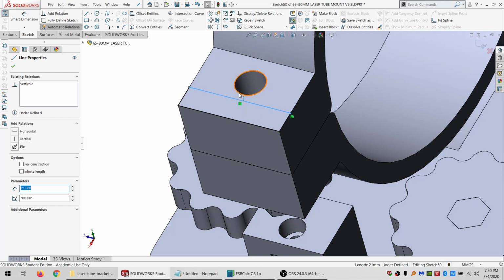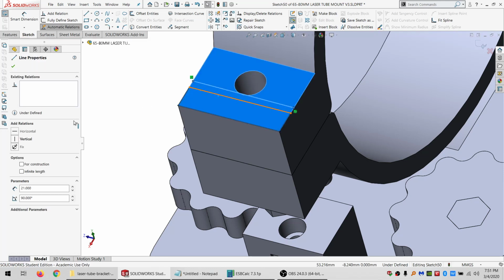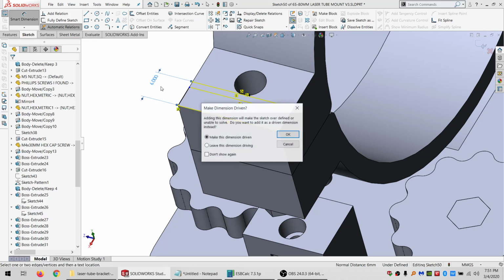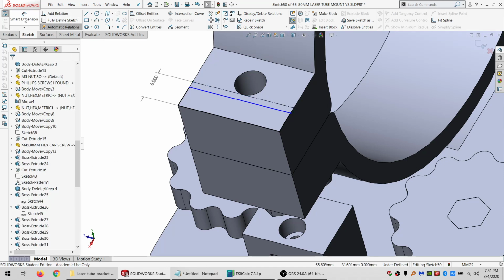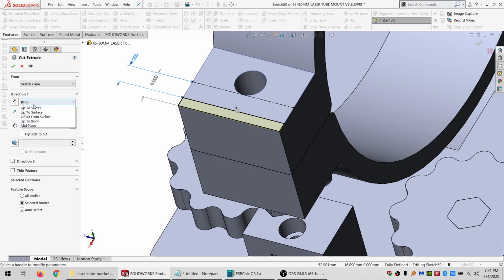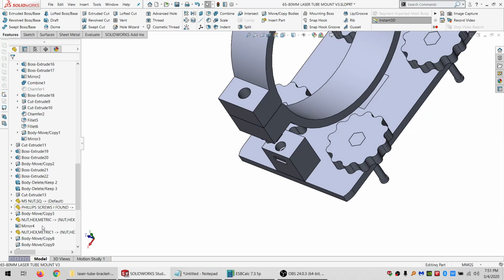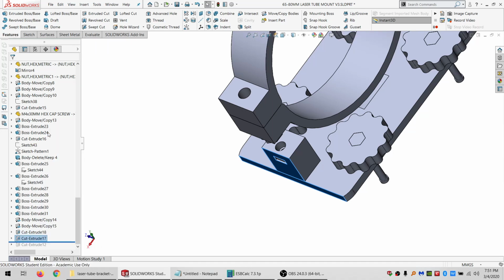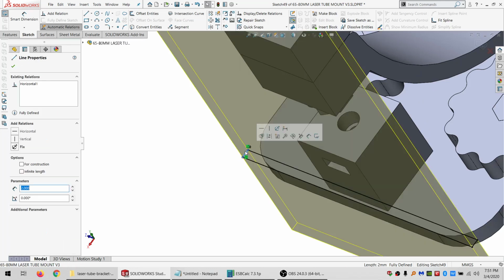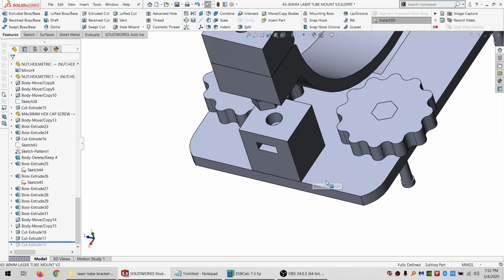And say, put another line in there, make it parallel. Make this tangent. And how much distance do we have right now? We have 6, which is way more than we actually need. I think 4 is enough. So cut those 2 down. It's still sticking out more. That's okay. Say I move this below here and edit this sketch. Instead of use this dimension, I just use this coincident. How much do I cut off then? Probably not very much, 2 millimeters. Alright, well, it's a lot of work for 2 millimeters, but it does give me a little bit more space to play with, so that's worthwhile.